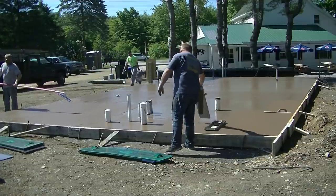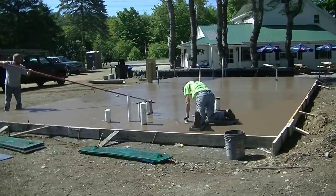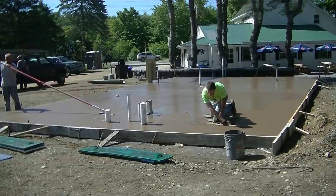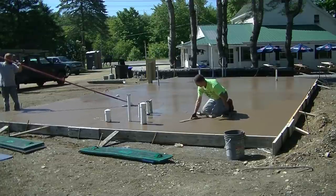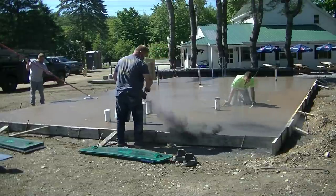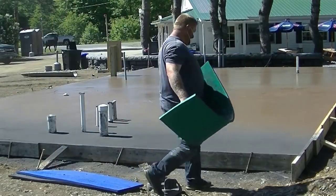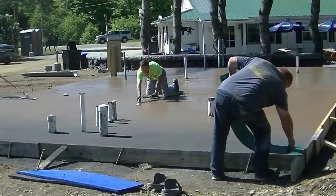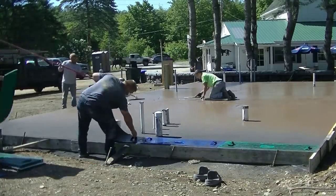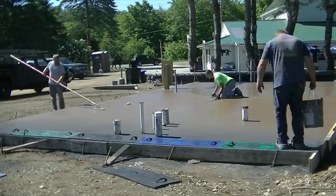So after about an hour and a half, this thing's ready to go. We know because it's hot out today, the sun's out, this thing's going to go fast. A thousand square feet of that barn board — you really got to be moving to do a thousand square feet out in the sun. The set of stamps — you've got 10 or 11 stamps. If you had two sets, if you had about 20 and had another guy or two, you could do more than this. But with a thousand square feet and only 10 stamps, we know we're really going to be moving. One thing on our side is it was two different loads about a half an hour apart, so we should be able to get the first truck stamped before the second truck is too hard. Plus on that second truck, there are some trees back there, so there's a little bit of shade working in on that back edge.